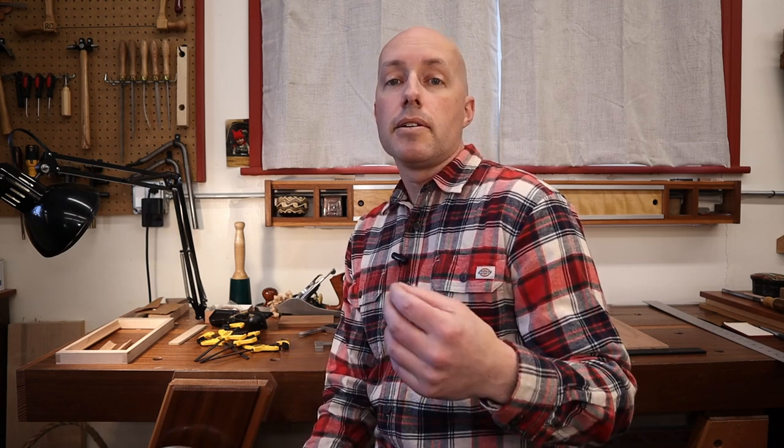And speaking of top-heavy, generally speaking, you put your more bulky, heavier items into your larger drawers. If all those are at the top of the case, you have a piece that is literally top-heavy, such that it might fall over on somebody. So having your larger drawers at the bottom of the case and your smaller ones at the top makes for a more grounded look, but also a piece that has a lower center of gravity and is more stable. So there's definitely a form-follows-function kind of thing going on there.